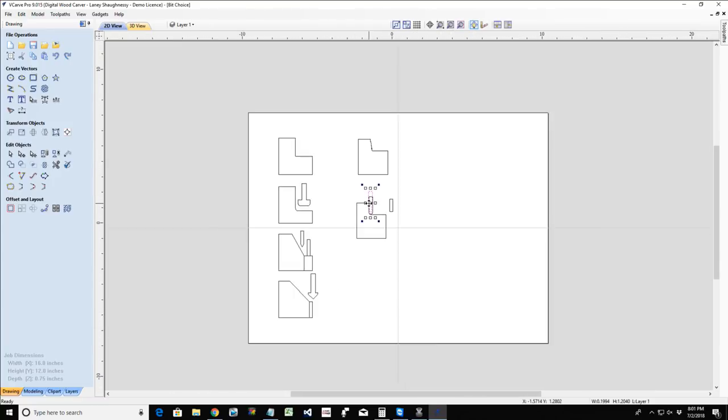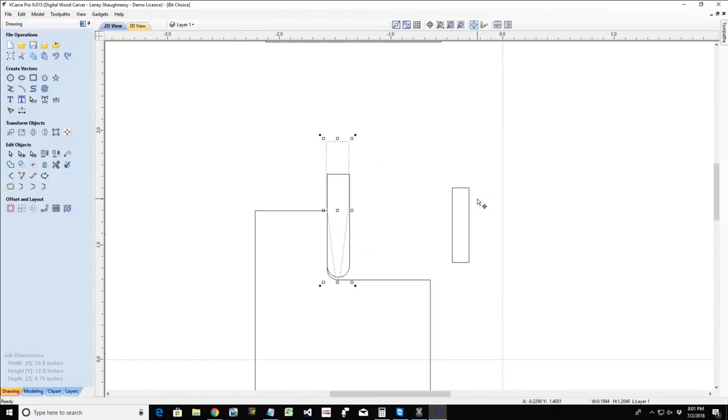So you've got to make sure that you calculate your toolpath with the correct bit that you're going to be using, because it creates two separate looking toolpaths. It's based on the bit and the profile of that bit. So you've got to be mentally aware of that. If I just say, oh, I'm going to use a 0.25 ball nose, that's a straight ball nose, but in my router I grab my Whiteside 705 bit set and my 1/8 inch tapered ball nose, my cut's not going to come out right because I've got the toolpath calculated for one bit and I'm using another style. So it's never going to look good.